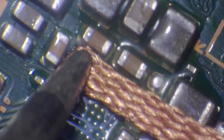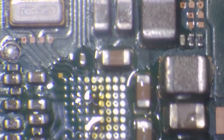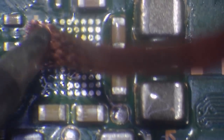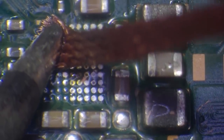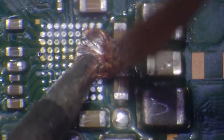I'm just replacing this solder with some leaded solder. The reason is I don't know whether it's leaded solder on there, and by replacing the solder it's going to lower the melting temperature, allowing me to wick it up to clean the pads relatively safely. You have to be super careful here because there's a lot of solder balls in a very tight area and they are very small — probably 0.25 or 0.3 millimetre. It doesn't take much to tear them.